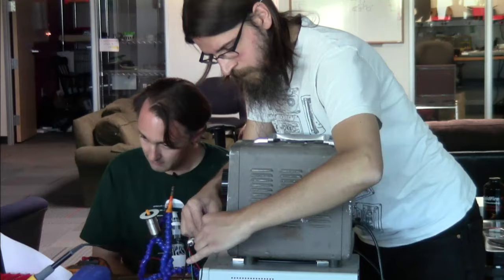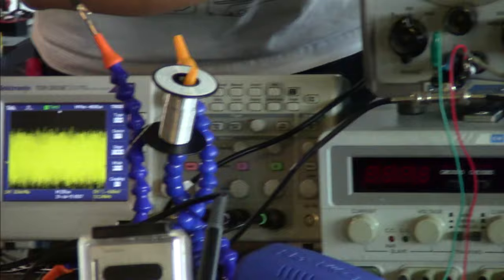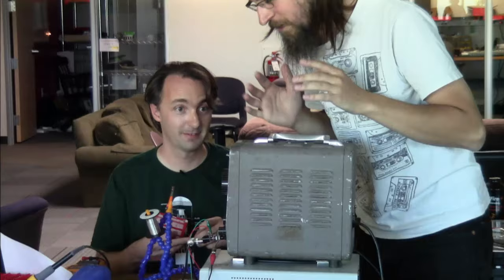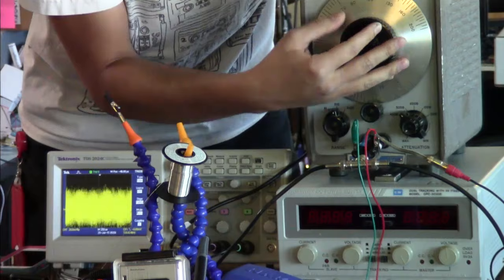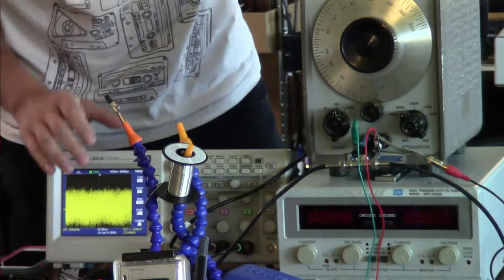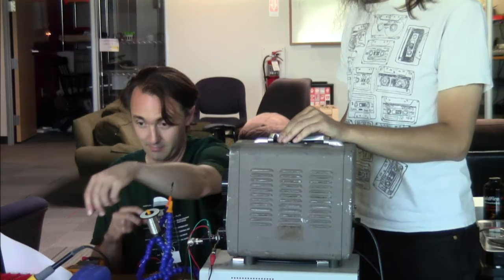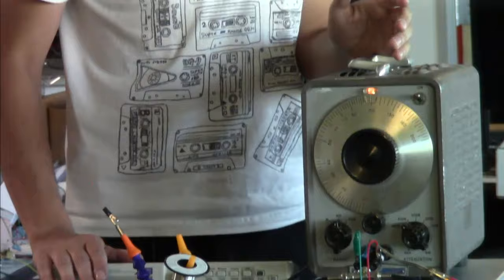Mike, can you turn the audio on the generator on for a minute? I'm going to sweep it around just to show what it sounds like. I can actually hear it coming out of the thing, too. Something's moving around along with the scraping knob. Sounds glorious. All right, so later we'll be able to apply this test signal, measure it on the input, and measure it on the output, and then calculate the decibel gain at that frequency. Then by taking a few samples along our frequency range, we can figure out if we're roughly in that curve that we've intended or not.